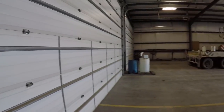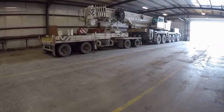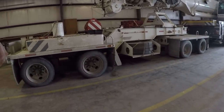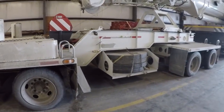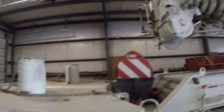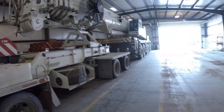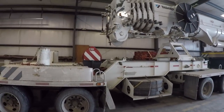As far as hydraulic cranes go it's kind of medium size, but it is the biggest one we've got. So there it is sitting in the boom dolly — it's a four-axle dolly that articulates underneath and supports the bottom of the boom. With this particular dolly we can haul one piece of counterweight with us, which is nice. The block here has to be reeved every time we take it out, and without this configuration the end of the boom swings out quite a bit when you turn, so it's not very safe going down the road.